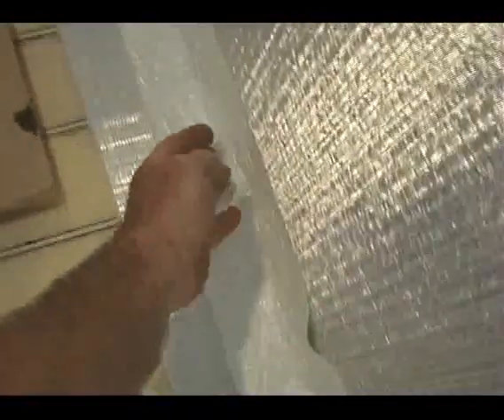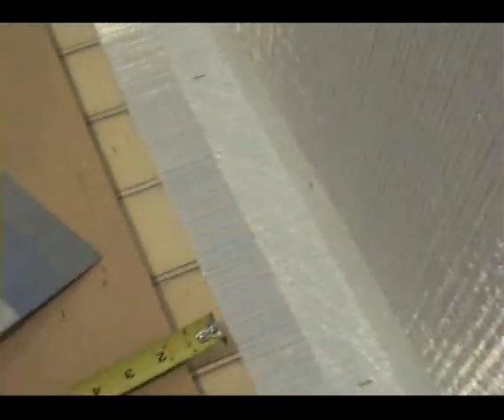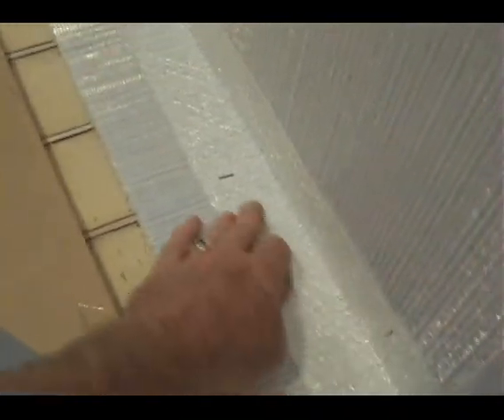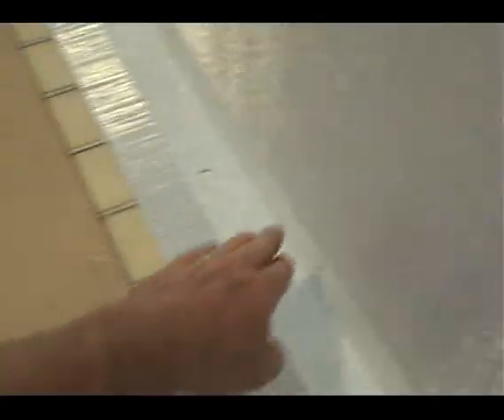Basically that will give me two layers on this side and two layers on this side. And then this little piece here is what's going to continue the seam from this floor section to the pontoon section. How I go about that is I add staples — just put lightly into the foam. As I'm pouring the resin, I'm going to pop that up with my fingers. I use my trowel to make the fold, press it down, measure my two inches, and shoot a staple there. That gives me my nice little corner.